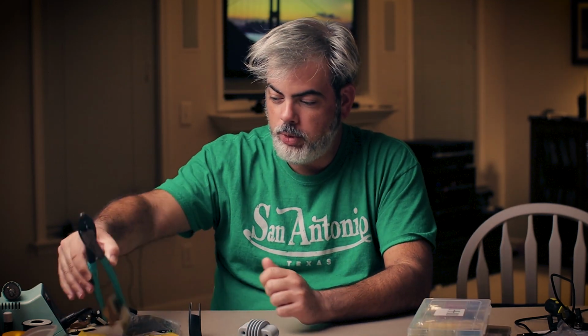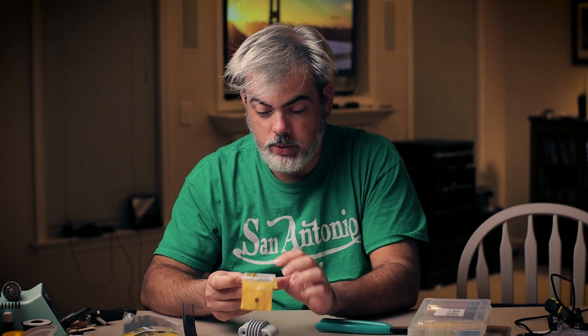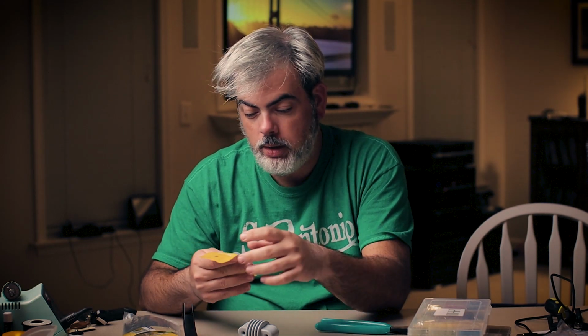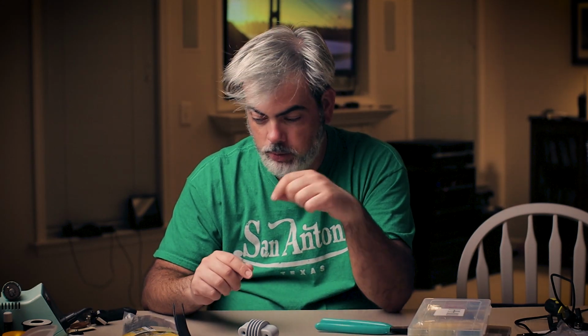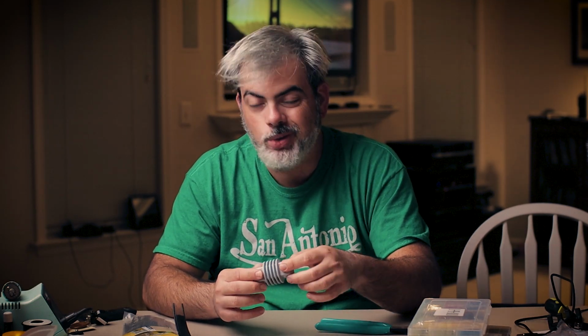We will need the appropriate tool for crimping said connectors. There's several of them out there. You probably got one, and if you don't, you can improvise. We are also going to use, like we've mentioned before, brass hardware. So we got a couple of brass number 10-24, 1.5 inch screws, which will fit through the insulator here quite nicely, not a whole lot of play. And if you're using stuff you have on hand and the screw's too big, you can drill these out a little bit.